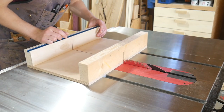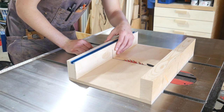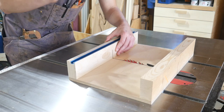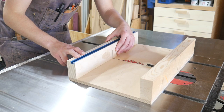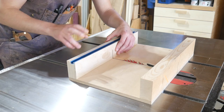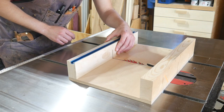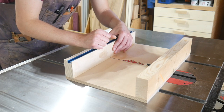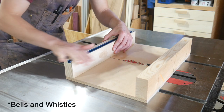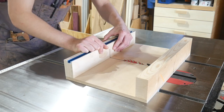The second key aspect we need to get right is ensuring the blade is absolutely perfectly square with the fence. There's a five-cut method to do this which I am going to use, but I've got a unique method on dialing the fence into position that you're going to find really useful and that gets rid of a lot of the frustrating aspects of making a crosscut sled. Other than that, anything you add is just extra tricks, but I make mine really simple and make sure I get those two things right.